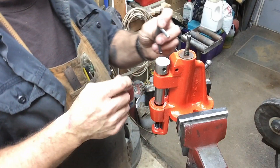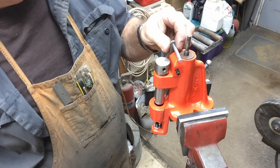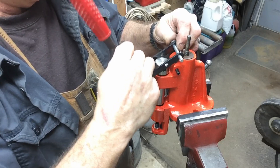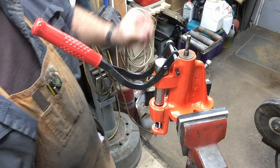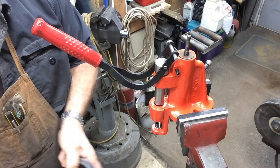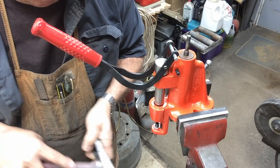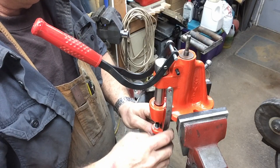I've got some factory hitch pins but they're a little bit too long, so we're gonna have to shorten them up. I think we want to deburr this just a little bit more — it'll have to be polished out and everything yet, but I think we want to lightly deburr the edges so we don't chew up our casting where we've got contact on it. Yeah, that'll take quite a little smoothing yet.